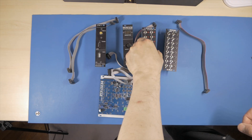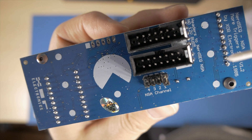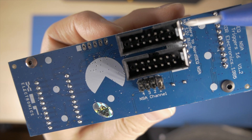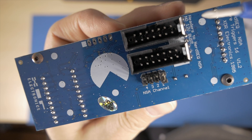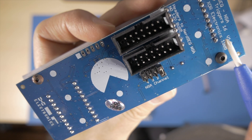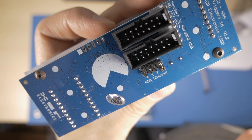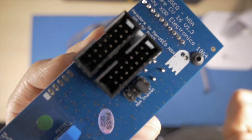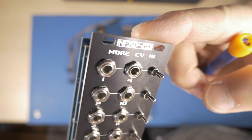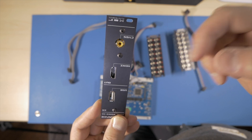If we look at the back of any of these modules, we find two ports of the same type. You connect the previous unit to one port and the next unit in the chain to the other port. The more CV expander and the more trigger expander — the NSA expanders — both have jumpers to change the communication channel, which needs to be unique for each expander module. So you could have the CV expander on channel 1, the trigger expander on channel 2, and so on. Note the more video IO expander — the one with the HDMI output — is preset on channel 4 and it cannot be changed.